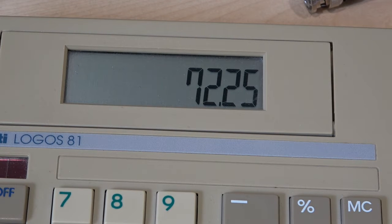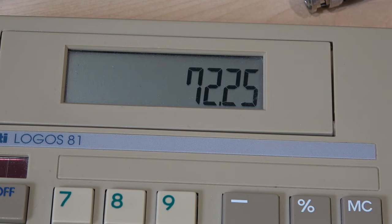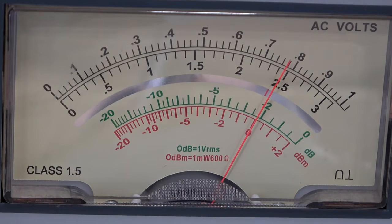As per usual, this is done the same way I always do - maximum clean sine wave just prior to clipping. If you do it the Chinese way at 10% distortion you get about 89 watts into 4 ohms, but don't be impressed with that because it's completely unusable - 10% distortion sounds absolutely hideous. Doing it the proper way: clean power into 4 ohms is 72 watts. And in music power this will be up to about 80 watts.